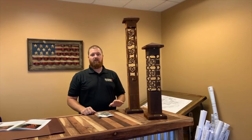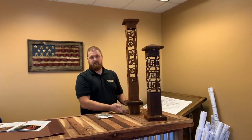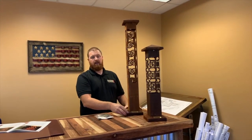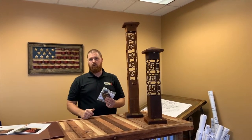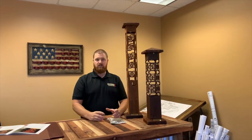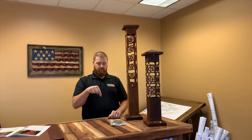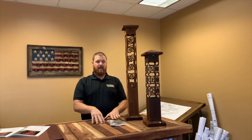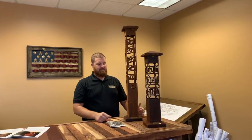These vary a little bit from the smaller Courtyard Series. They actually have a base that comes out of the bottom of this fixture and accommodates stainless steel anchors, so every bollard comes with its own hardware kit. You typically would put these on a concrete pilaster or a footing of some sort, let it dry, take the base out, drill the holes, put the anchors in and tighten it up, then slip the bollard over that and tighten it all up from there.